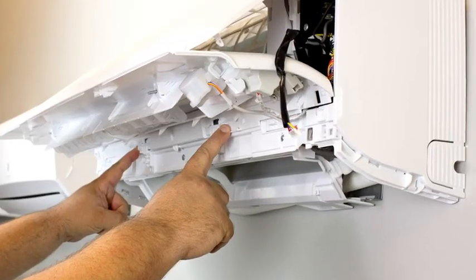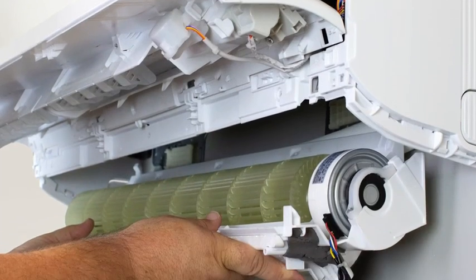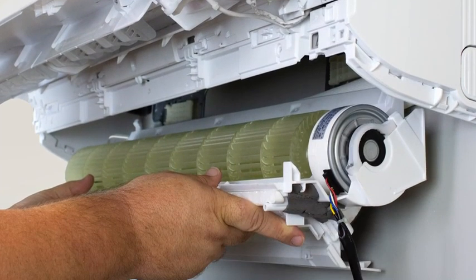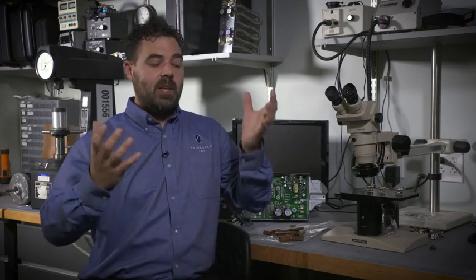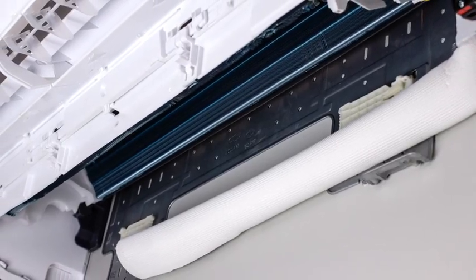What makes FastPro so much better is that with a couple of screws, you can have the evaporator and the blower housing in your hand, take them out to your truck, and wipe them down and brush them off. And because the evaporator and blower housing come out, you can essentially go up inside and clean the coils both from the front and from inside the back.